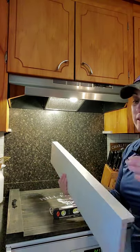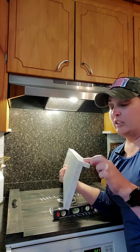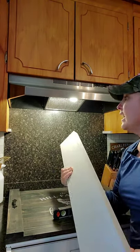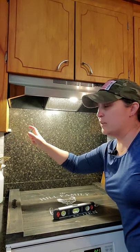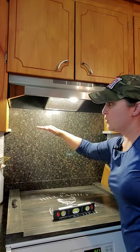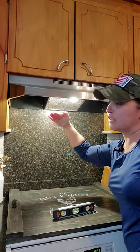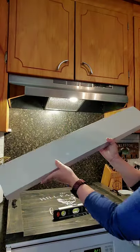What I did was I took a leftover one-by-six from the floating shelf build and a three-eighths by two inch hobby board, glued it to the front, and painted everything. I added these little brackets back here — just cut-off pieces of wood that I nailed into the cabinets. I made sure it was leveled so my shelf wouldn't lean forward or lean backwards.